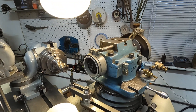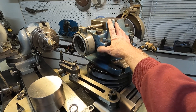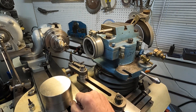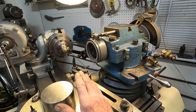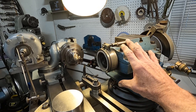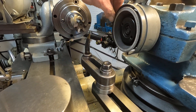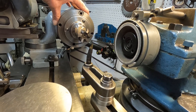There's another thing going on here: some grinders have a tilt head, and actually most of them do. To grind those secondary angles with a non-tilt head, you have to reposition the cutter in relationship to the wheel. They call it the indicator drop method, and it's explained in the Cincinnati manual.